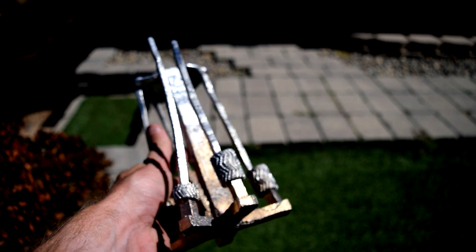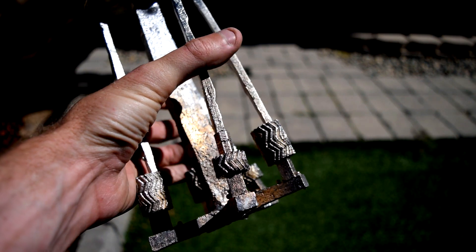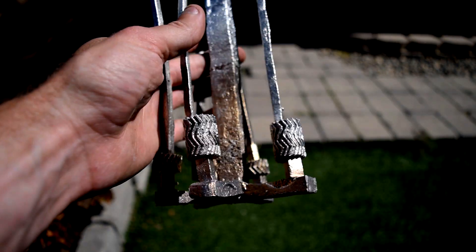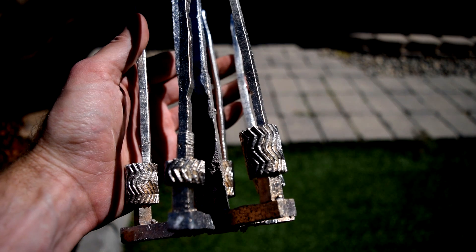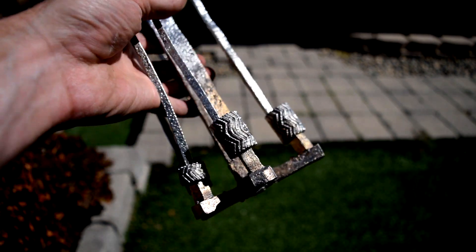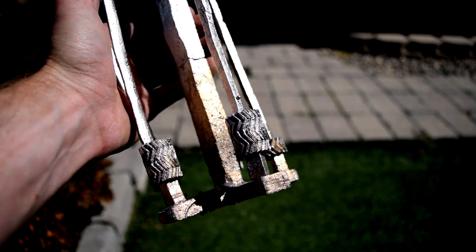Here's a little tree of gears, and it came out damn good — I'm really surprised. There are a couple little bubbles and issues in some of the gear teeth, but altogether all of them filled. We'll have to do a little bit of grinding probably in the valleys of the gears on a couple of them — either a Dremel tool or a file or something. They all came out really good and I think this will work. I'm really impressed. This is by far probably the hardest casting I've done and it came out great. So let's get these sprues all cut off and separated into individual gears, and we'll check out how they look.